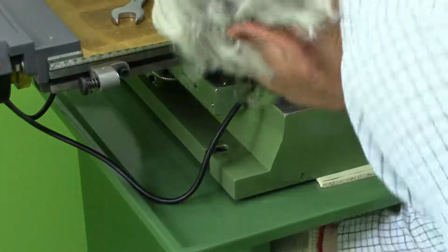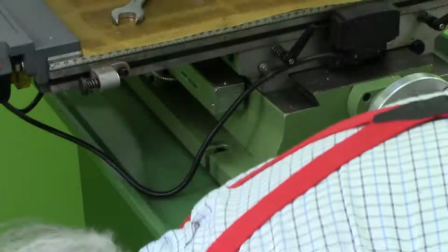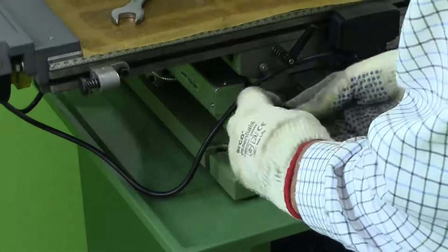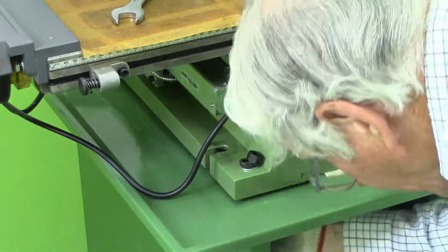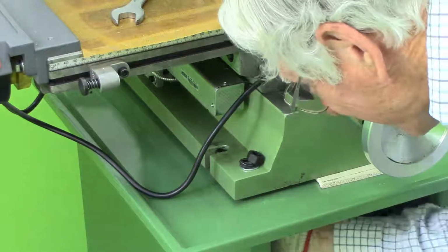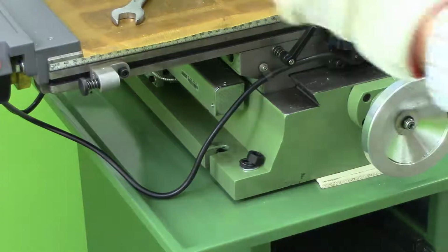This bolt is flush with the top here. Alright, it's got the thickness of one thickness of plywood lifted up. And if I put that down, you think I'm going to be able to put a flat washer and lock washer and that on top and still engage the nut? You must be bloody mental. So that's one thing Warco didn't get right, isn't it? Because that will not go up any further. So, we actually need bolts slightly longer than these, which I might actually have.